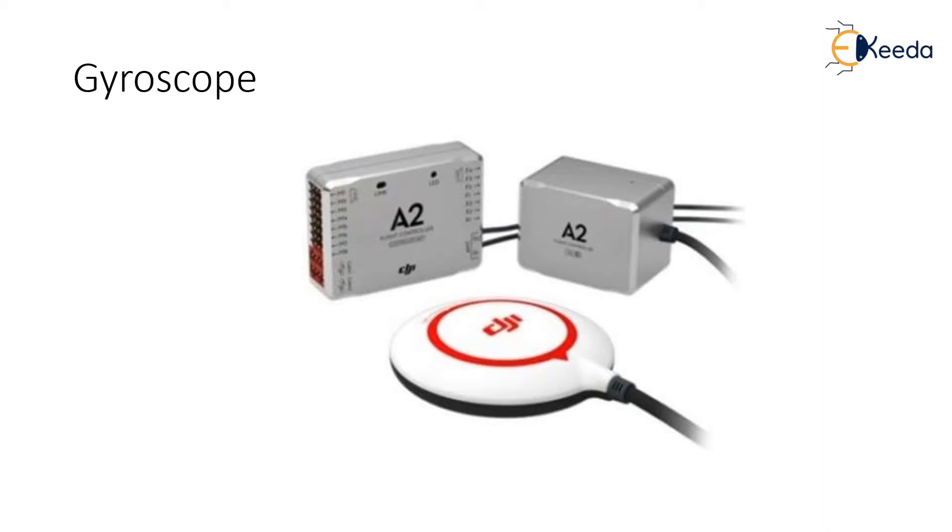The most basic of the drone sensors, gyroscopes, are cheap and basic enough to be integrated into even cheap mini drones. Despite the very simple scientific principles that govern how gyroscopes work, they are still highly essential tools used for navigation in high-end aircraft and space shuttles. Gyroscopes work on the principle of conservation of angular momentum. Simply put, a gyroscope consists of a spinning disk mounted on a frame. While the disk is spinning, the axis of its rotation remains in place, regardless of the tilting or rotation of the frame. By establishing an inertial reference frame, a gyroscope can be used to determine the rate of rotation, degree of tilt, and angular velocity of a moving object. Gyroscopes are an all-round tool used for measuring or maintaining drone orientation.